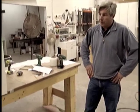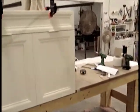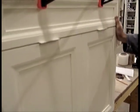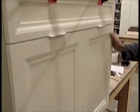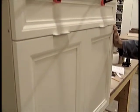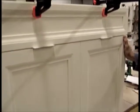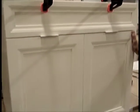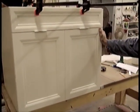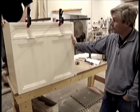This is a kitchen we're building for our client right now. It's a solid maple painted door and melamine box construction. It's a mitered door construction with finger joints on the corners for strength and rigidity. It's got a couple of coats of lacquer over top of a pre-catalyzed primer to seal it in really good and protect it against any moisture problems in the kitchen.